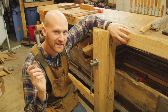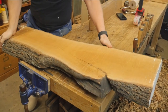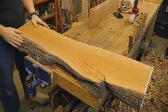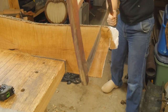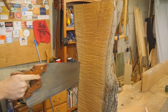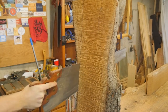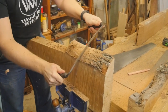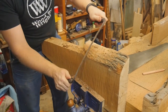I want to take you through some of the steps I did on making the new vise. You all know my favorite wood — white oak — but this is cherry. This slab was given to me by a friend I met through the channel, and it turns out I had met him previously through college. It's a beautiful, massive slab of cherry, and I found it would be absolutely perfect for this chop. First thing I do is cut it to a dimension and shape. I want it to be very narrow at the bottom and full width at the top with live edges. I initially wanted to keep the bark, but decided against it. With a draw knife, I was able to remove the bark but still keep the natural live edge.